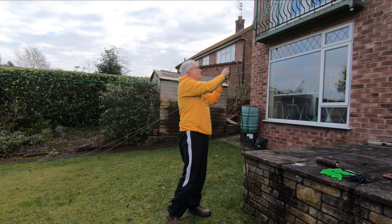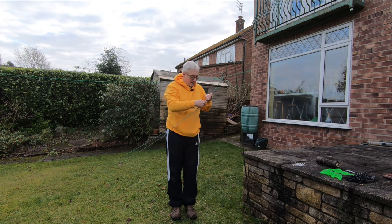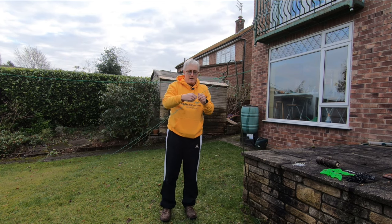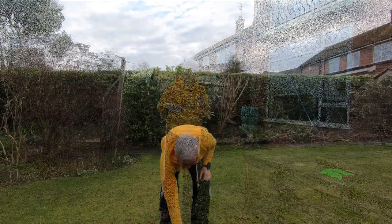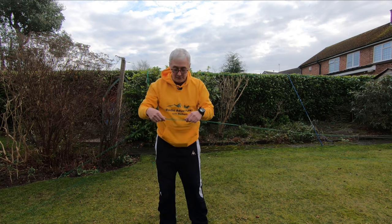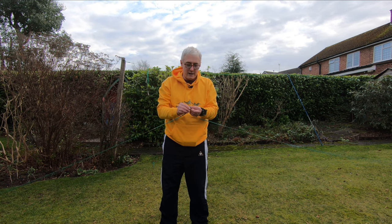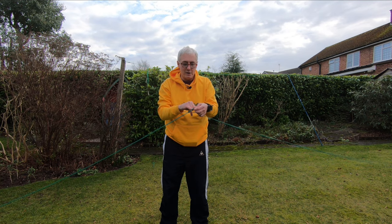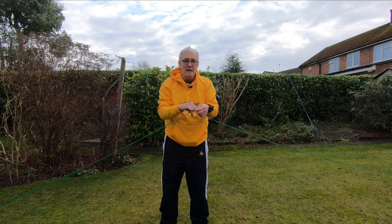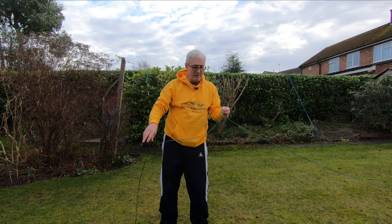So now I'm back with the two ends of the wire and I'm going to tie them together in a knot and slip that over here. Then I'm going to walk along the wire keeping both sides together so they're exactly even in length, walk up to the seven meter point, and mark that. Pulling these two wires taut, this is going to be where the center point — or the feed point — of our antenna is. I'm just going to bend the wire slightly to put a mark in it so I'll be able to find that point easily.